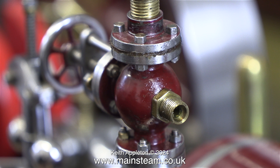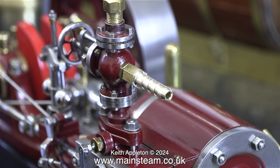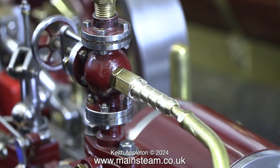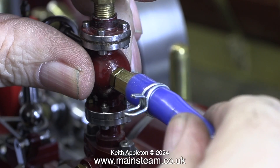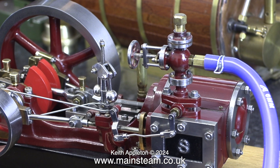Here is the original quarter by 40 union on the valve — all I'm doing here is screwing the new fitting onto that. Because I used a taper tap followed by a plug tap, the thread is more accurate; going straight in with a plug tap can cut the thread oversize. I'm lubricating the engine cylinder using my oil can, which locates perfectly in the centre on the end of the fitting. Once that was done, I simply slid the piece of silicone rubber tubing onto the fitting, followed by the clamp. The spring clamp presses the silicone rubber tubing into one of the depressions on the fitting, and it is very unlikely to blow off with the pressure I'm going to be using.